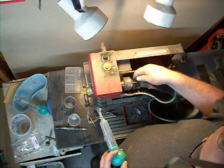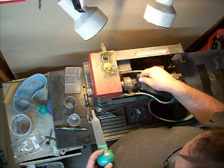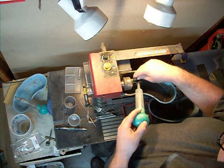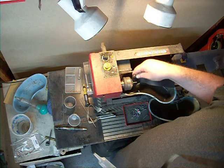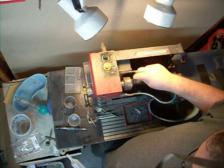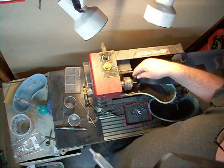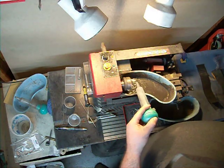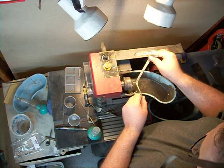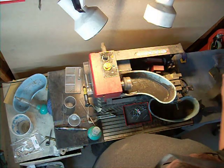After a little while you'll feel when it gets slicker than it was before — you'll hear that it's not grinding as much with the grit. Then at the end, roll the paper over the outer edge of that nail head so that you can smooth it just in case it touches the wheel, giving it a smooth surface. We don't want any undue friction on that axle head. What the water does is remove any of the metal shavings and any grit that's come off of the paper. Then I'm going to use a lint-free cloth — an artificial chamois — to buff off any water, grit, and metal particles so that we don't contaminate from one grit to the other.